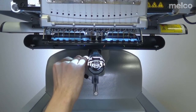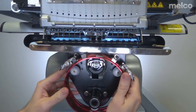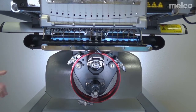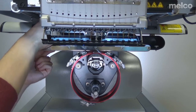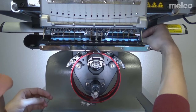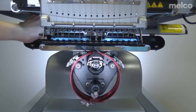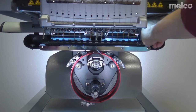Apply a couple drops of oil to the support shaft, ease the driver on over the lower arm with the bearing block going over that lower support shaft, and then the bracket going right onto the carriage. Install the thumb screws. You can slide the driver a little bit left or right if you need to, to line them up. Tighten the screws an eighth to a quarter turn more with that 6mm Allen wrench.